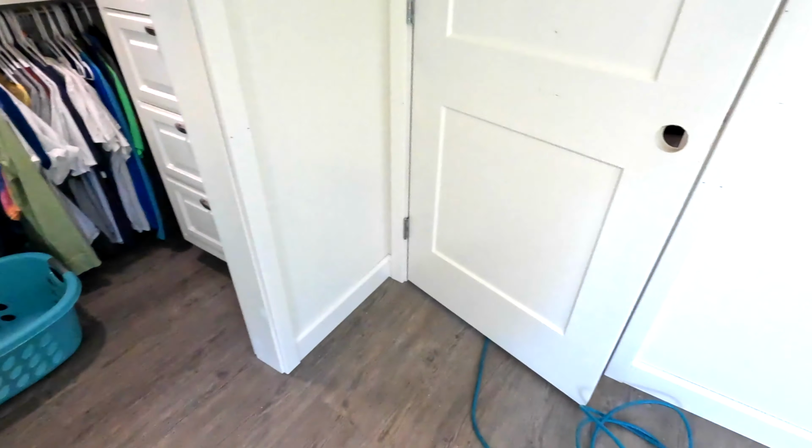I've taught all of my finished carpenters that worked for me over the years this, and this is how we coped all of our base. And the nice thing is, there are no callbacks. And again, just take a look. No filler, no caulk yet. So now I'll do the same thing to the next room and the two bathrooms.